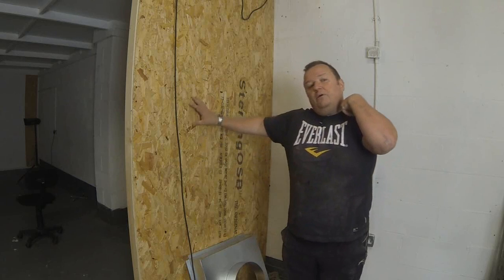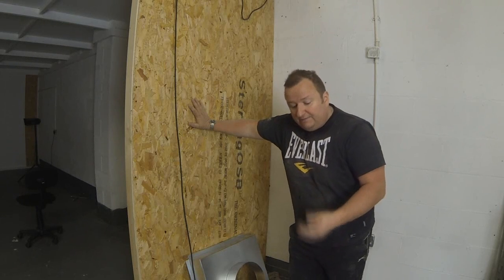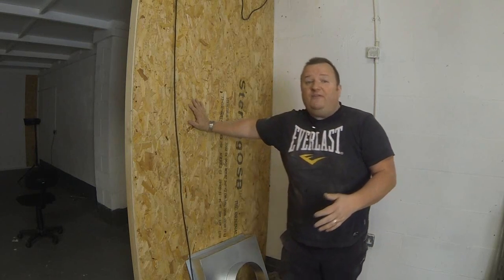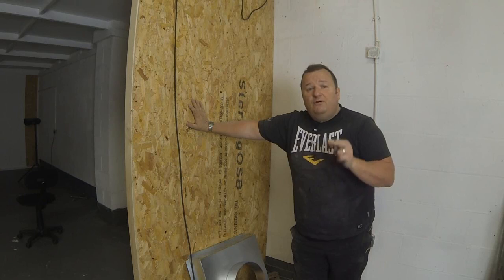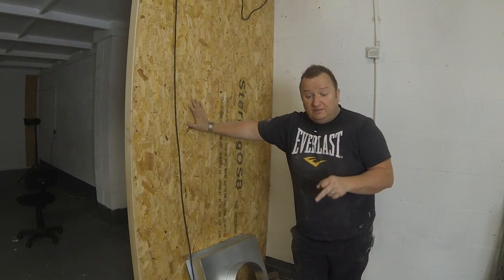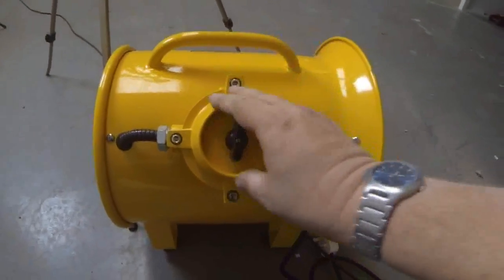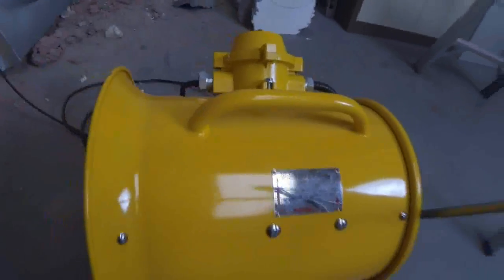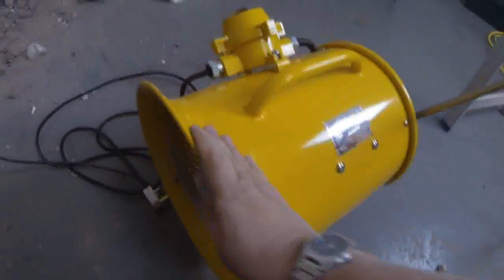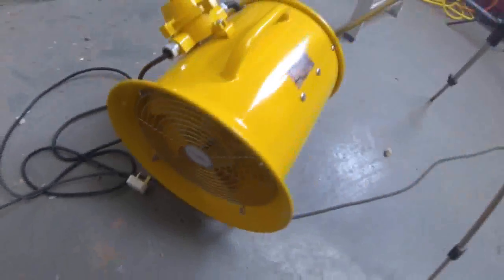If there's not enough airflow, we've got two options: fit another fan directly underneath for twice the power, or put a smaller intake fan on the other side to push air towards the exit — providing the intake fan is smaller than the extract, you'll maintain a negative pressure booth. This fan here from Power Star Electricals is an ATEX-rated, explosion-proof fan, which is something you really need. There are loads of cheaper fans on eBay that are not rated for explosive atmospheres, and this one is. It's a big 12-inch, 240-volt unit, and I believe they sell them on eBay and Amazon as well.